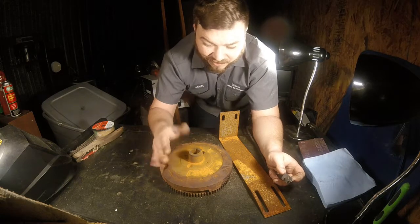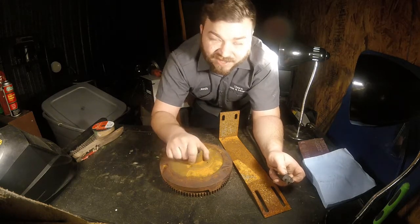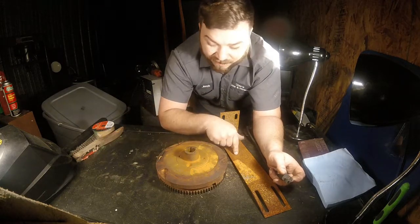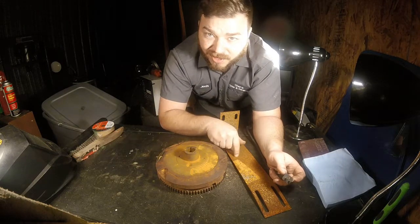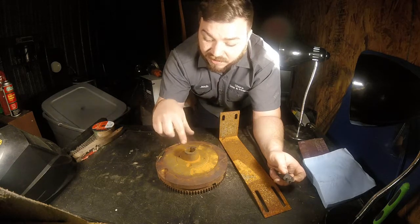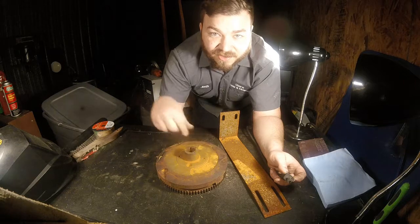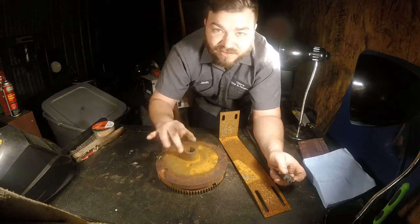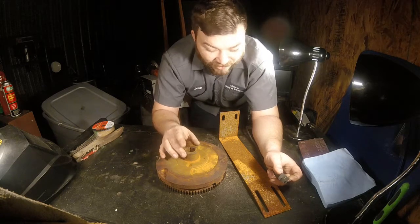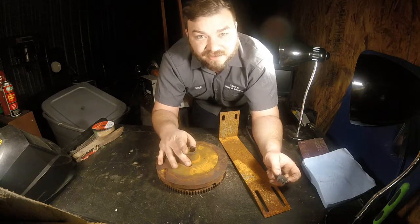It's going to work kind of like a microphone stand. You've got the heavy base. I'm going to make a small round plate to go over here. I guess I'm just going to cut a square out of this, tack it down to this, and then cut a circle off of it, grinding the edges down to a circle with an angle grinder. It's going to be ugly, but that's awesome.